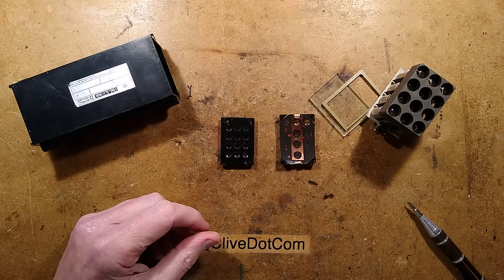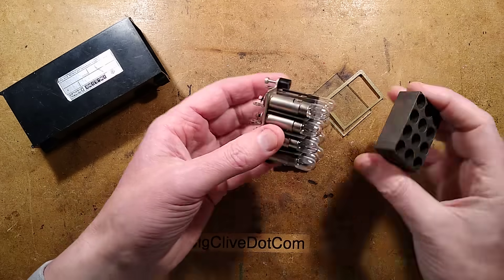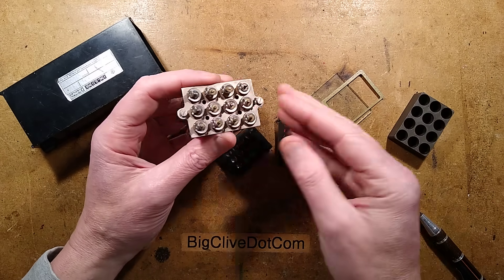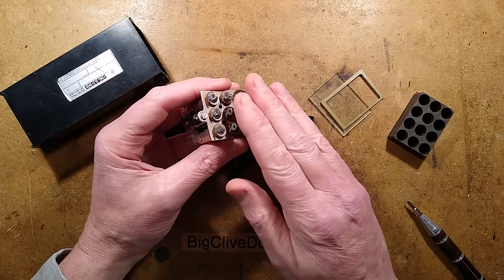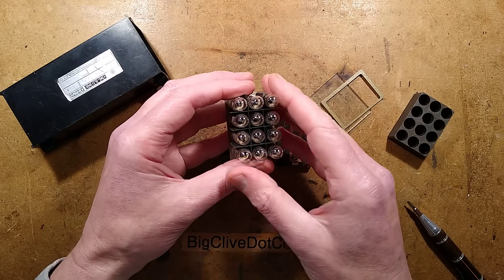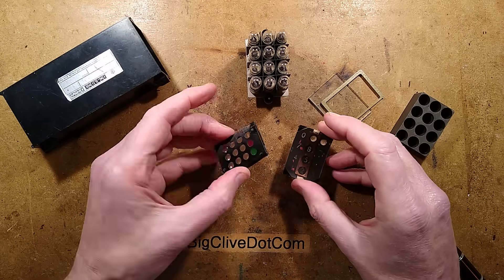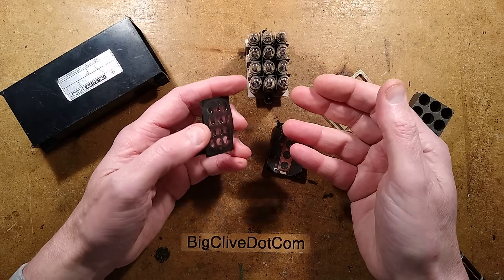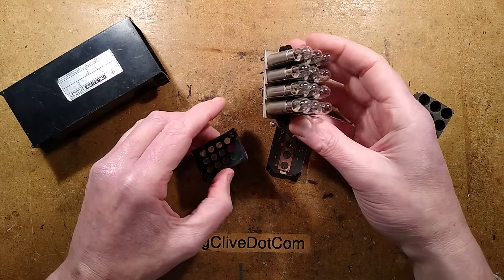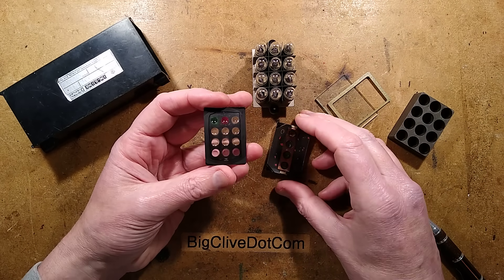It's very simple in a way, but also quite complex. Each housing had to have 13 wires going to a common wire, plus 12 for the individual lamps, making it a fairly high current display. At 24 volts and 100 milliamps it's fairly high power. For 6 or 6.5 volt lamps, that would potentially have been four times as much current just to get the same sort of intensity.